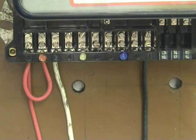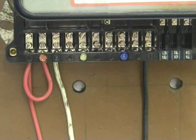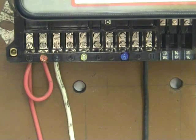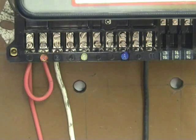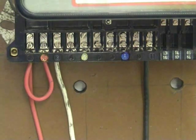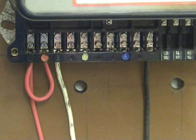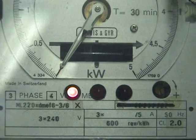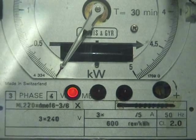This is for Felix, YouTube member Felix 2417425. He has a KVARH meter which is rated for 3x100 volts, so it's a different arrangement. It measures KVAR, so it probably needs a phase shift to make it work for a resistive load like lamps and heaters. I'll set this meter up that way and with a bit of luck we'll get it to work.